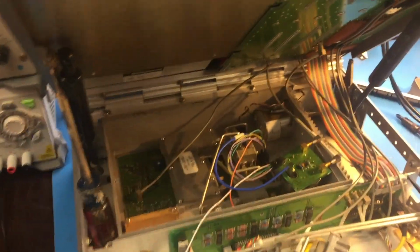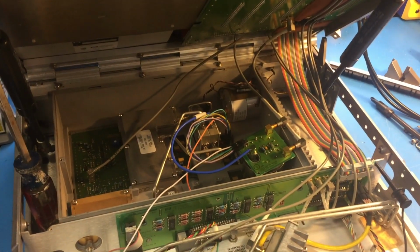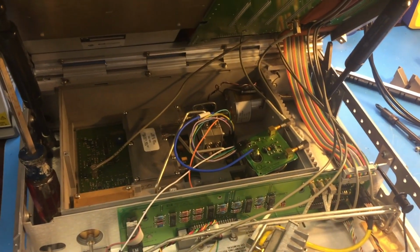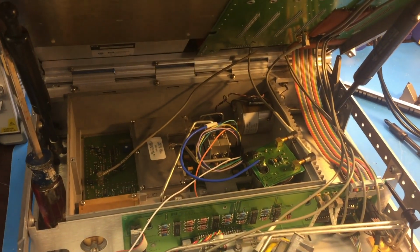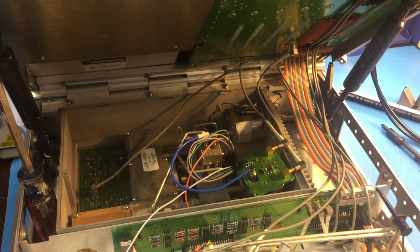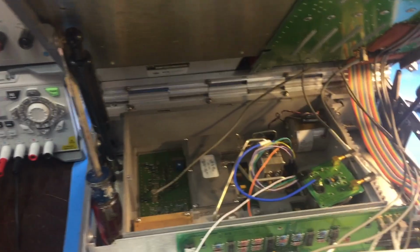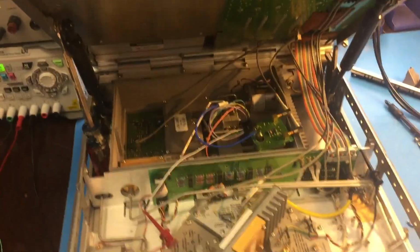So I've got to see what the hell is going on with the 15 volt supply. It seems like it's weak. It seems like it's not happy. It's got some problem of some kind. We need to investigate that and see what's going on here, because it looks like the 15 volt rail is current moding too early. It seems. Because this thing is happy, that's not drawing excessive current. I don't know what the spec is, but I'm sure 200 milliamps is fine. Yeah, so let's just take a look around the power supply and poke around there.